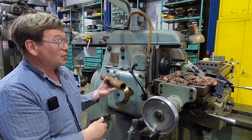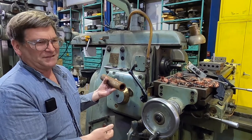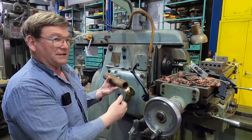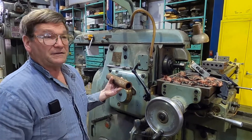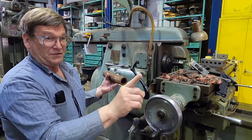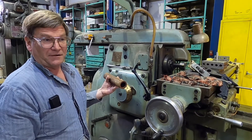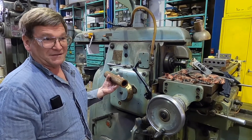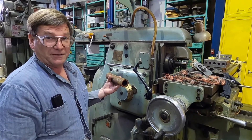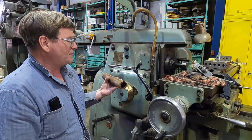There's no run-out other than any out-of-round that the bearing may have in itself. So it's really a normal everyday occurrence. If you need to repair a spindle, you don't have to send it in to somebody and spend hundreds of hours rebuilding it — you can re-grind it. You can do the same thing on an engine lathe: take the tapered surface and carefully grind it, grind the face, make them flat again. Don't give up just because it's gotten beat up.